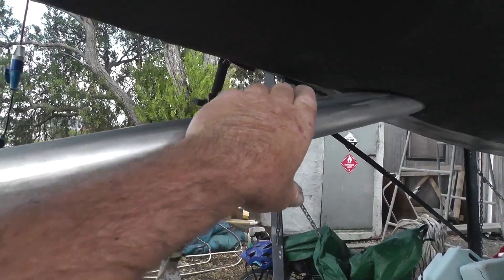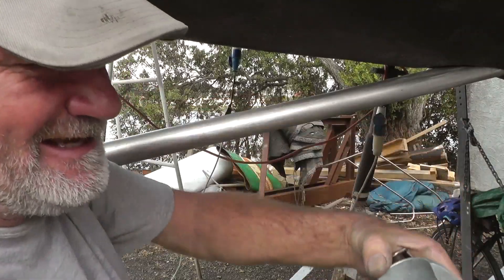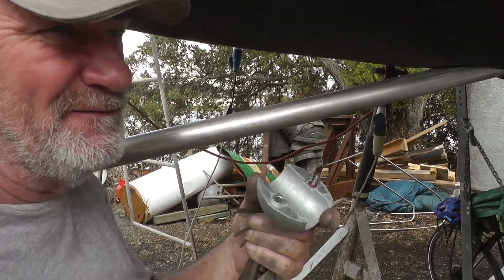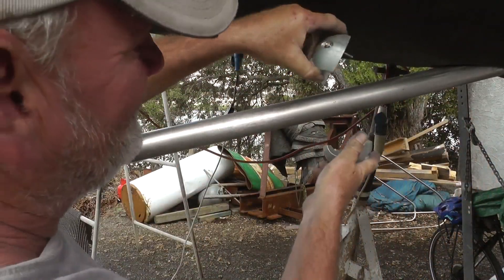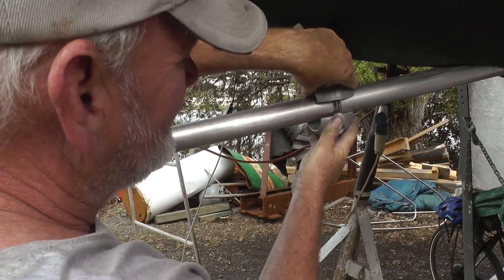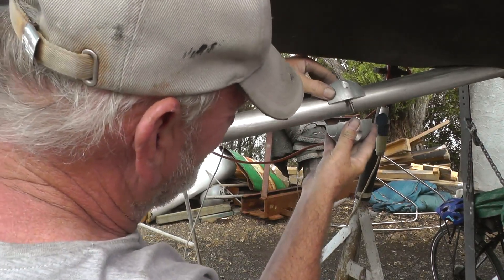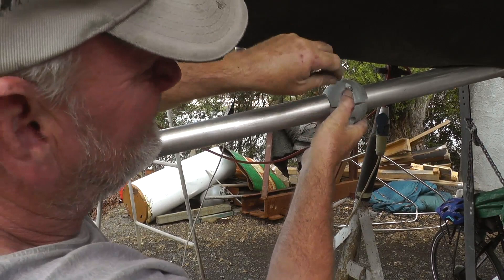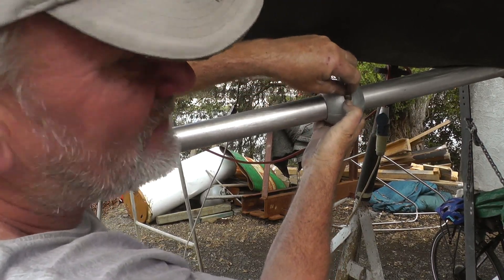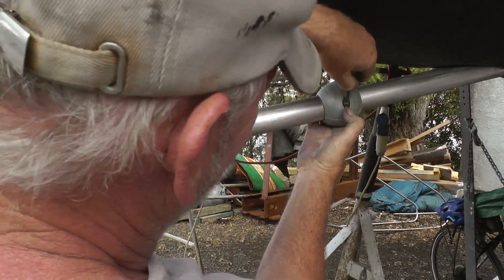Time to put the anodes on the shaft — got that nice and clean. I've been trying to do this scene for ages. I cannot say 'sacrificial anode' very well, but I said it there. This is a sacrificial anode — it's one of eight that fit on the boat. They absorb extra electrical activity; if it's wandering around, it destroys this before it destroys the metal of the boat. That's the idea — hence the word 'sacrificial anode.'